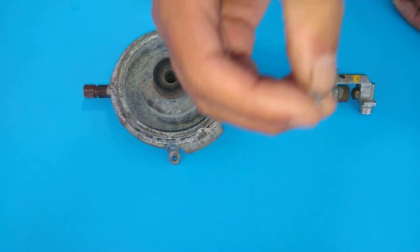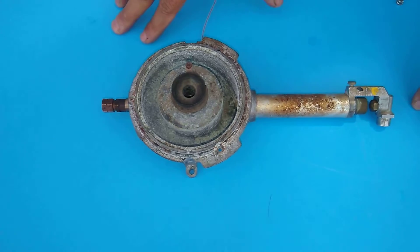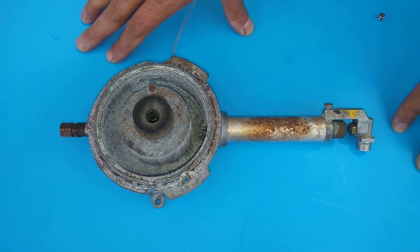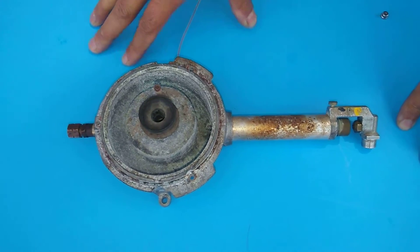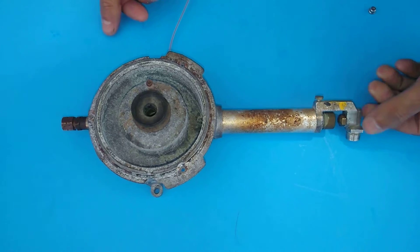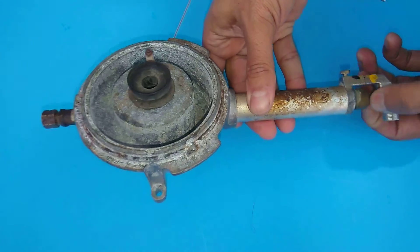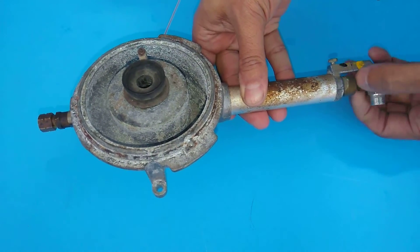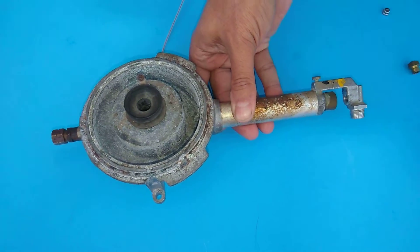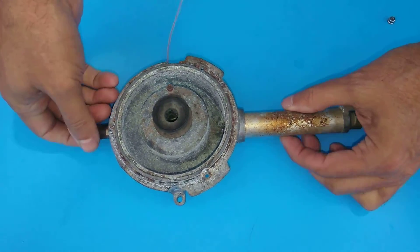This part sits inside the low flame circuit. If you're going to convert this burner — which is what this video is mainly about — you're going to change two orifices. You're going to change the low heat orifice, which is for the center part of the burner cap, for the very small flame. And you're going to change the high heat orifice. The high heat orifice just comes out like this — take this one out, put the new one in, and you're done on the high heat.